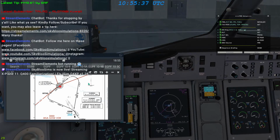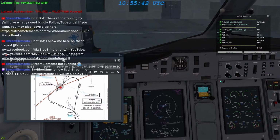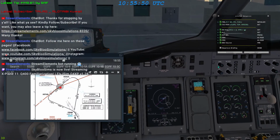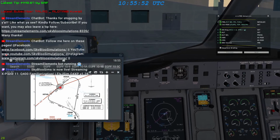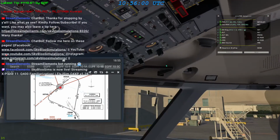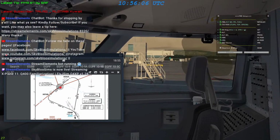If you encounter a problem on departure, we'll, actually I'm gonna make this 051. We'll climb until MSA and diagnose the problem. If the emergency is quite urgent, we'll make a left downwind for runway 05, commence emergency landing. Threats, it's an uncontrolled airfield, so on pushback we'll turn on our wing lights and logo lights so that we can be seen by more people.